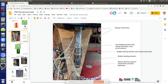That'd be a good idea. Because otherwise the nozzle, like if that heater element is a little bit above, whatever's exposed on the nozzle, you're just dropping temperature right there. Yeah, that's all that's happening. Temperature above that, maybe higher, but you want the temperature to be good at the nozzle because you don't want it to solidify. You want it to be the hottest point.